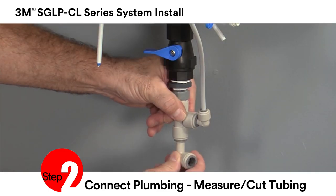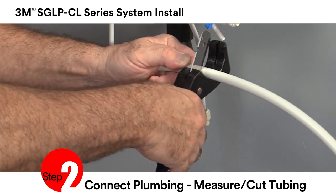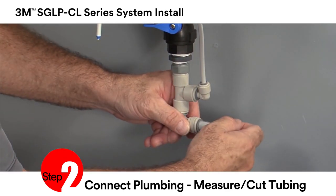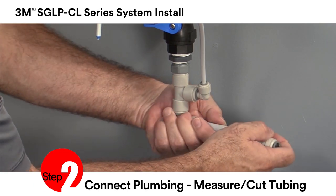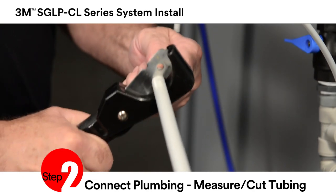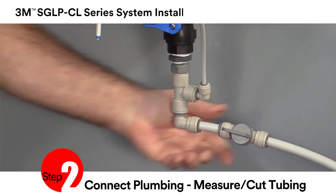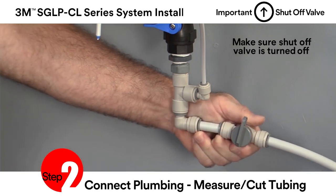Connect a 1/2-inch stem to the quick connect elbow fitting into the T-fitting on the bottom of the tank. Cut a 4-inch piece of 1/2-inch tubing and connect one end into the elbow fitting. Connect one end of a 1/2-inch quick connect shutoff valve into the other end of the 4-inch tube. Cut a length of 1/2-inch tubing long enough to reach the steam equipment inlet connection. Connect one end of the tube into the other end of the shutoff valve. Make sure the shutoff valve is in the off position.